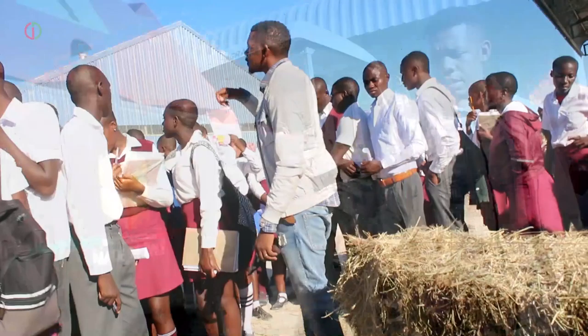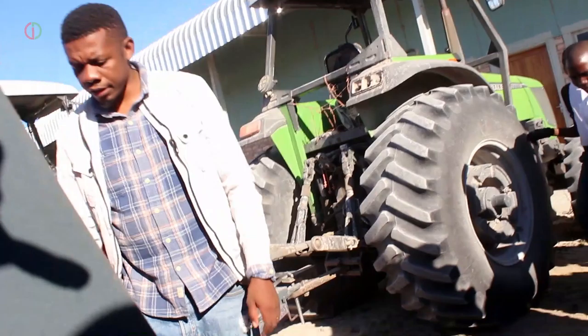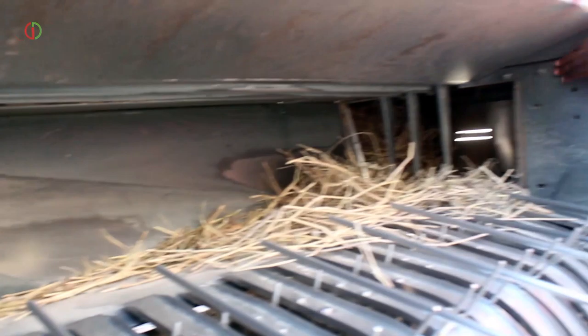The bale machine, if you come here, you'll see that these are pullers. What they do is they rotate like this, they pull the grass in, and then this thing here moves the grass for compaction. So it compacts and compacts, and as it's compacting, it's moving. The compacted grass is going to that other outlet there. You see it there, yes, where the grass is.